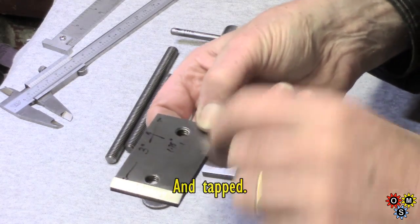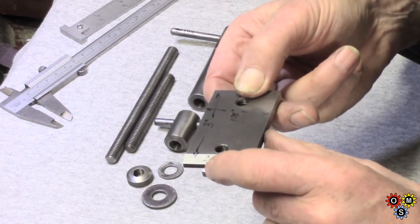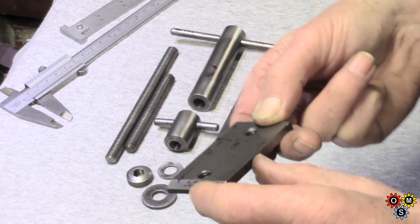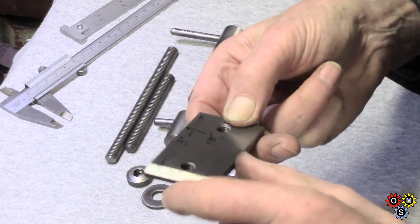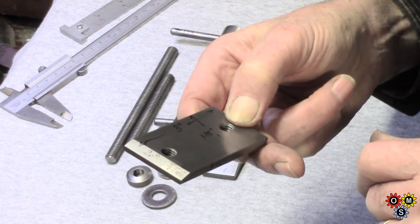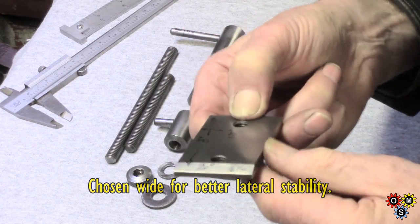It's drilled. I think the centres for the drilling are fairly empirical. 2 inch centre. And then there's a bevel on this edge. Now bear in mind, these were made before I had access to a vertical mill. In the old days all I had was a big horizontal mill, and I did these by hand. Roughed off the main material and then draw filed, and that's nominally 20 degrees, not overly important really. And this is quarter plate. Alright, 3 inch 1 3/4 by quarter, and a bit of bevel at the front.